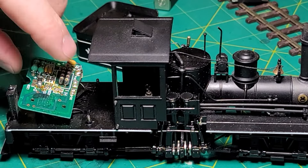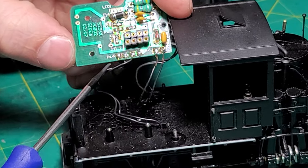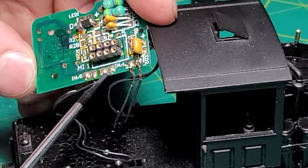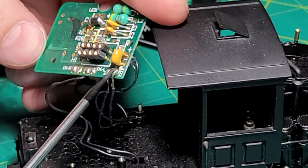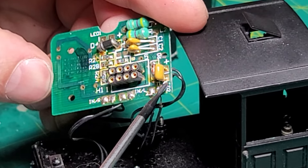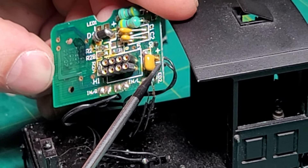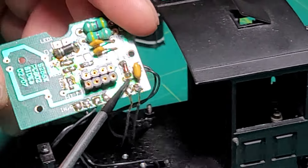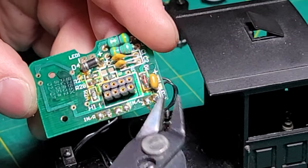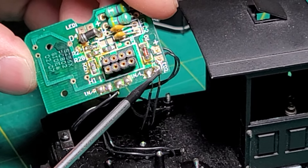On the bottom, we're going to label all these wires. If you look in here, there's 'in right' and 'in left,' and each one has two pads. Then there's a positive right there — it says 'LED' right here, though it's kind of blocked. That's the positive and negative of the LED for the headlight. And there's a little 'M' right there — the capacitor is blocking it — but underneath it says 'M,' so that's motor positive and negative.